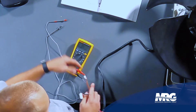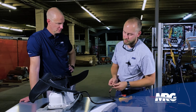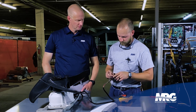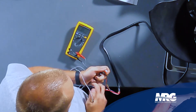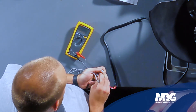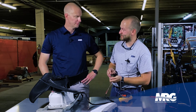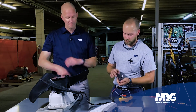So now we're going to check this connector. We've got these other three wires — we've got U, V, and W. Yellow is your U wire, blue is your V wire, and orange is your W wire. So I'm going to take my black lead and stick it in the gray wire connection, and then we'll start at yellow — we're just looking for consistency amongst each one of these. We have 20.8K ohms on the yellow wire, 20.9K ohms on the blue wire, and then on the last wire we have 21.1K ohms. So that's pretty balanced — we want to be within 20% on this connector.